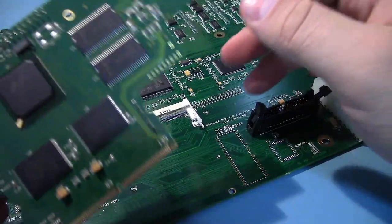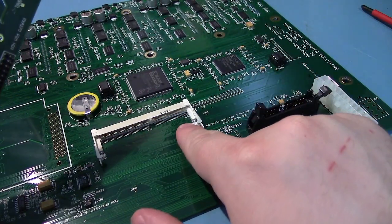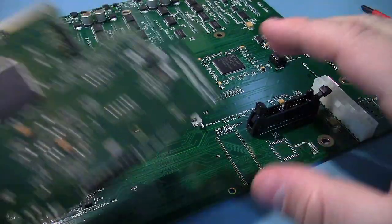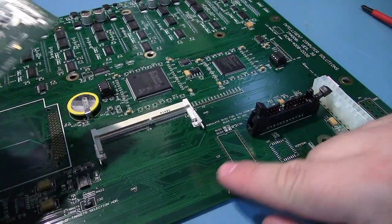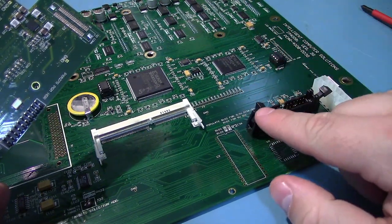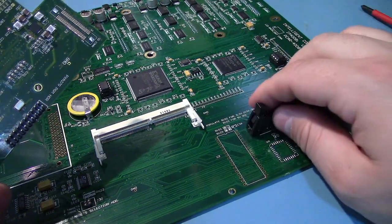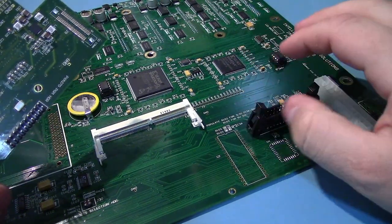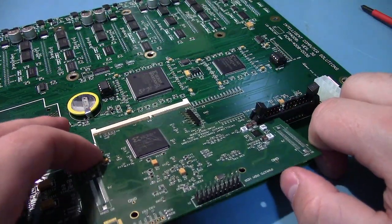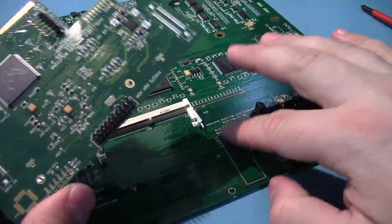Weird. As you can see, there's a daughter board that goes right here. And this appears to be a standard PC100 SODIMM connector that they just happen to be using. And this is another one of those cases where they've not really taken into consideration the fact that they're going to be using these headers. So obviously, with the shrouded header, they didn't think of this when they first built it, because this doesn't clear with this in the way. You have to really bend it, and it's just not pretty hooking this up.